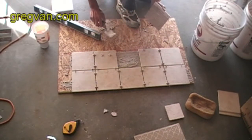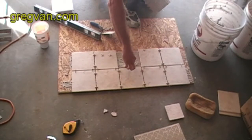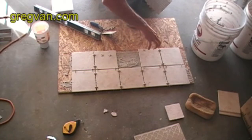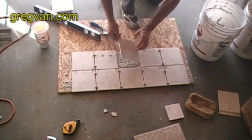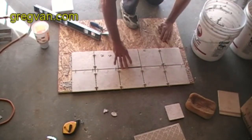If someone steps on it — pop — they broke the tile. So be generous. Anything that you miss in the corners can be filled with grout. Push the grout in and it'll go underneath and provide a lip for the tile to rest on.